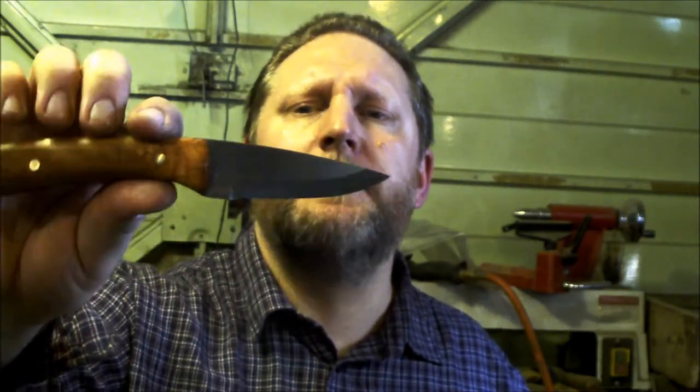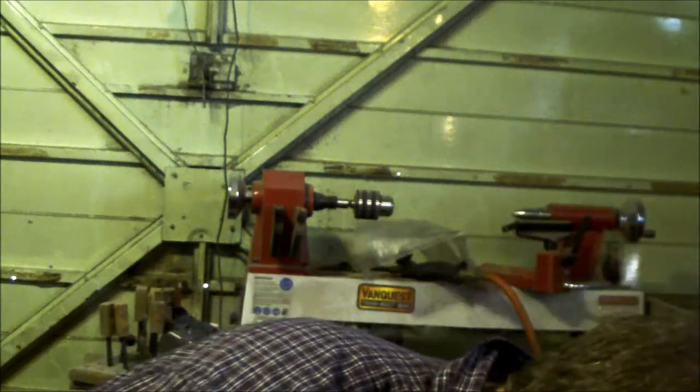But of the knives, I'm getting into the Merlins and the Danelaws, but when I get hold of a Galahad, it's elegant, it's lean. If you notice the new shape, Merlins are slightly leaner, which just makes it, as I say, elegant, it's lovely. So in 52-100, quite a lean grind, and then with a terminal bevel, puts the robustness back into the tips. It's not Scandi, 11 degrees per side. It's a bit leaner than that. Also keep my angle to myself, but the Galahad.